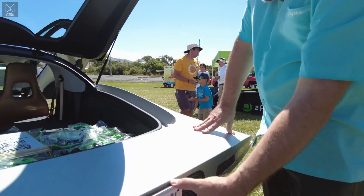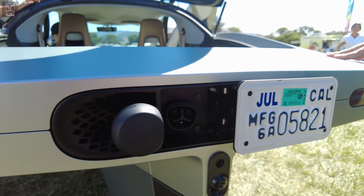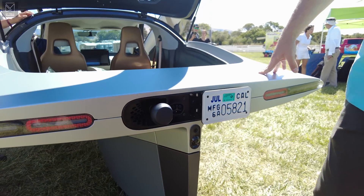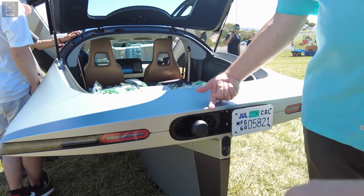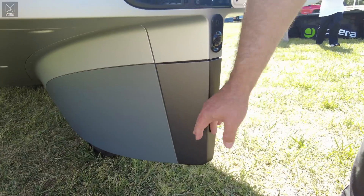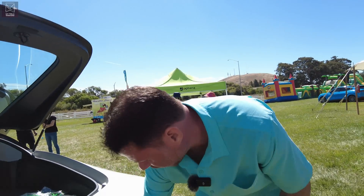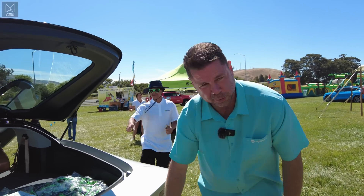Pushing the next standard and saying this is superior engineering is what caused other companies to say this plug is dumb — we should be using the Tesla plug. And here's the NACS port — silky, in all its resplendent glory. This is the perfect spot because it's the easily replaced piece. So if you got in a little accident you take this off, and it's also how you get the side wheel cover off: you take this off, the front section off, undo two bolts there and two bolts on top, and then you can take the cover off.